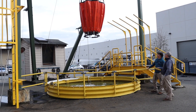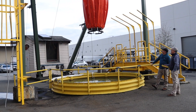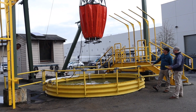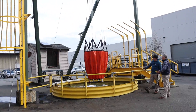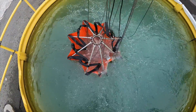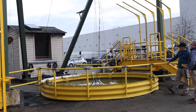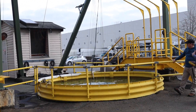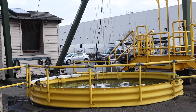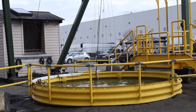What the pilot is going to do is come down and dip the bucket. He can open the valve simultaneously, which will help it dip a little faster — doesn't need to, but opening the valve a little bit helps it dip faster. If the water's deep enough, he's going to get a full sinking. If the water's not that deep, you might need to use forward motion to kind of pull it through the water, and then pull it out.